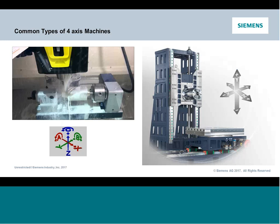Whether it's a machining center or an open machine, it really doesn't make much of a difference. It's still a vertical machining center, vertical meaning the Z-axis is moving in a vertical orientation. And there you see one with a traditional 4th axis table, bolted right to the machine's table, typically used more for parts where we're machining on multiple sides. So I'm getting a single part off the machine, but maybe I have some more complex geometries to cut.